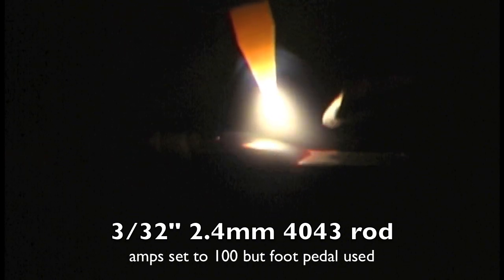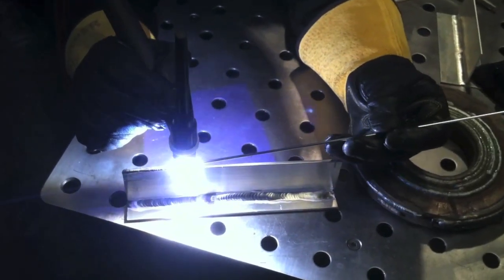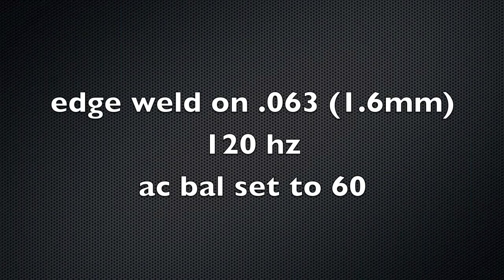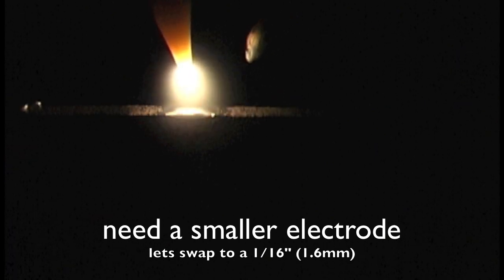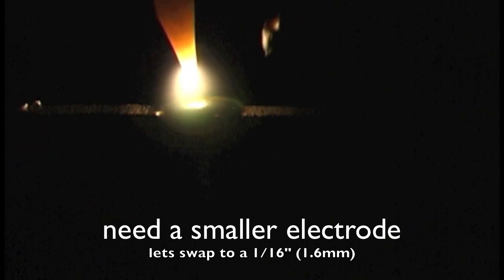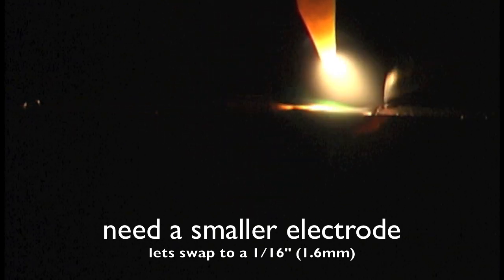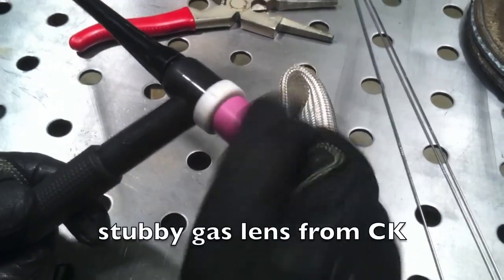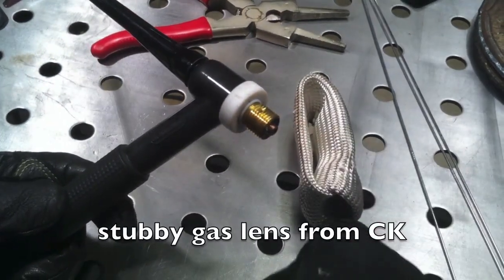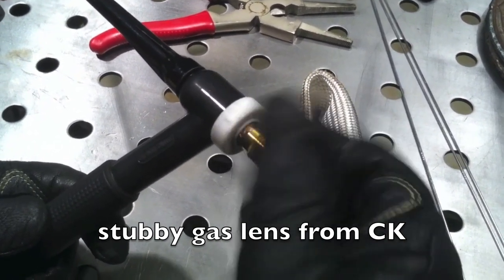You want to wet out and move at minimal heat — you don't want pepper in the puddle or contamination. The edge weld can split the argon with a Venturi effect and get contaminated, so you want enough cleaning to take care of that. Now we're switching to a thinner edge weld — 1/16 inch, which is 1.6 millimeters. The arc isn't very stable because I'm still using the 3/32 (2.4 mm) electrode, which is too big, so I'm going to swap down in electrode size.